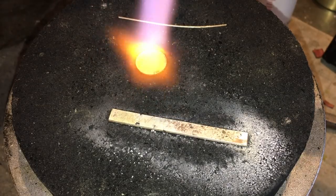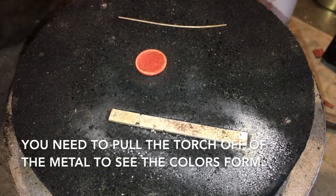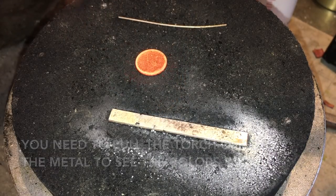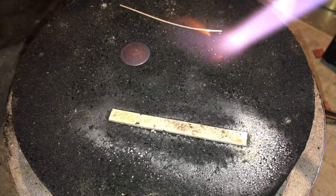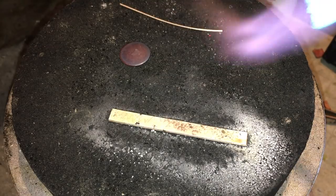For the copper disc, I'm looking for it to turn multicolored and then gray — you hit the colors and then it goes gray. That looks like a good color. For the wire, I'm just going to run down here a little bit, especially the end with the tape on it. This doesn't actually need to be annealed, it just needs to be cleaned.